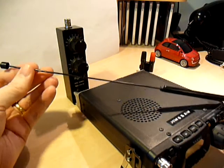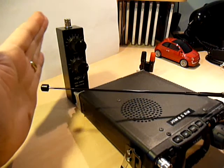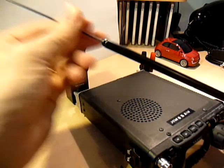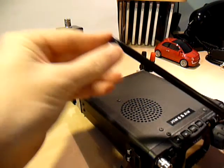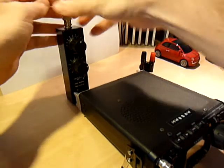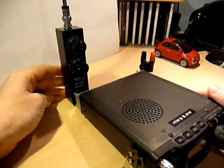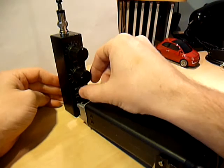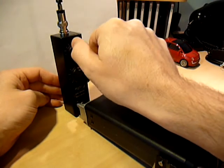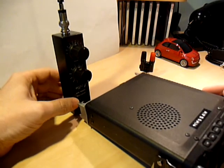The antenna is quite delicate, so it's quite easy to bend — it's best not to push it in roughly, best to put it in gently. It extends all the way out like so — quite a tall antenna. This slots into the top there. It's a standard LC-matched antenna; you select the inductor on the bottom switch and capacitance on the top. I think the power is limited to 10 watts.